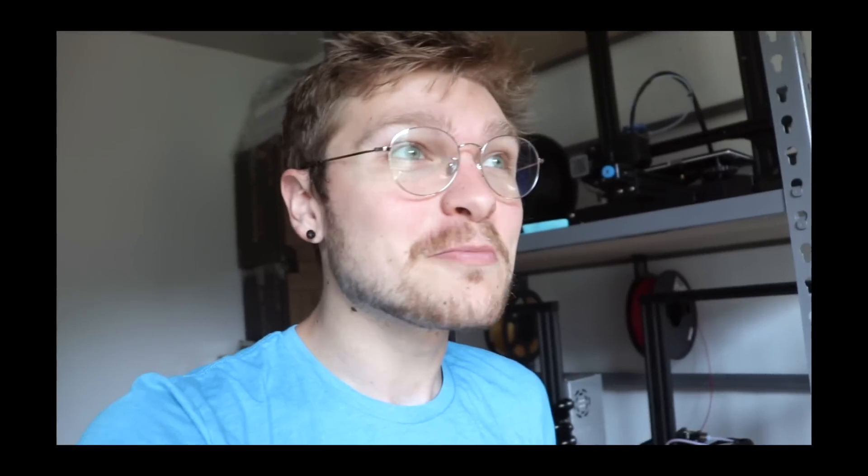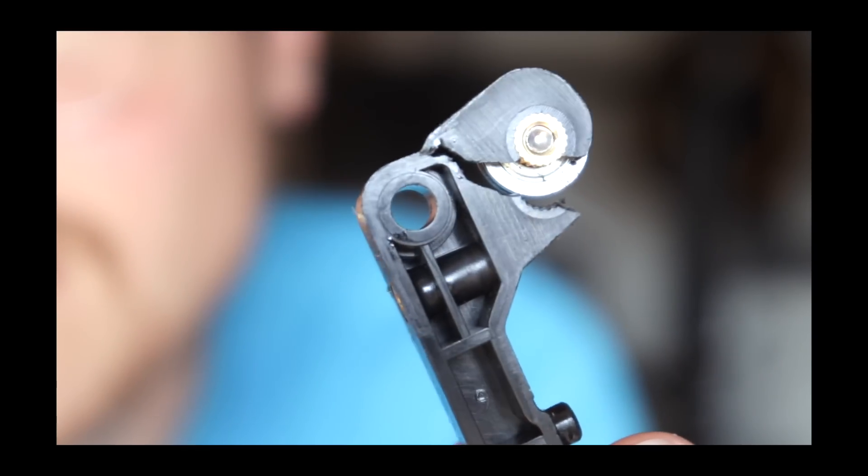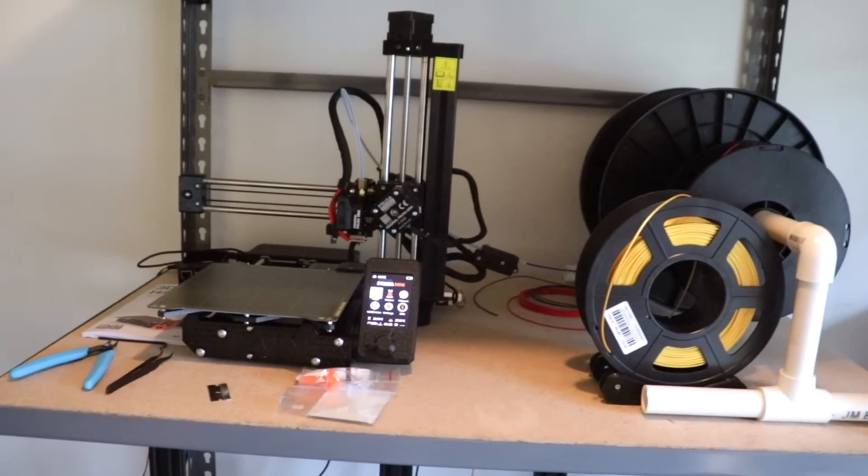I just need these printers to be working right now and they're just not. So I did a dumb thing — I took an extra long bolt for the tension on the idler wheel that pushes the filament up against the hobbed bolt, and I pushed it way too far, to the point that it literally broke the arm that holds the idler against the gear. After asking my patrons for advice, a lot of them recommended I look at a Prusa Mini. The Prusa Mini is not too much more expensive than an Ender, but so far it has been so reliable — I kick a print off to it and it comes out the exact same way every time. Beautiful quality.